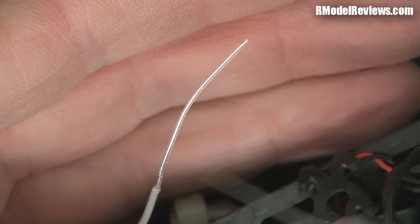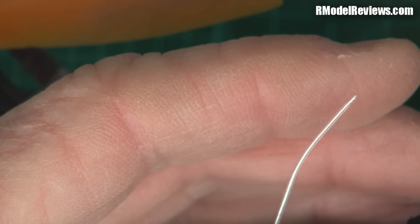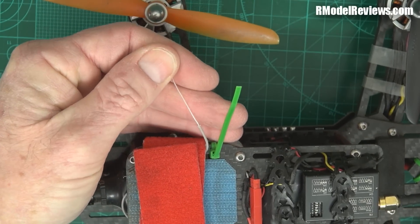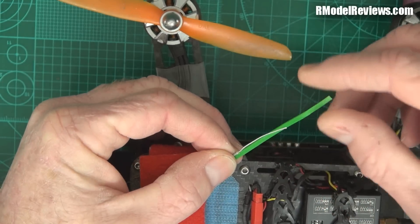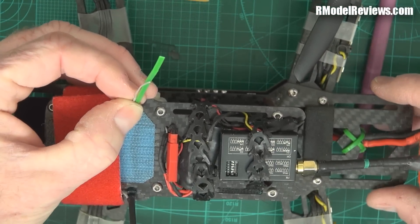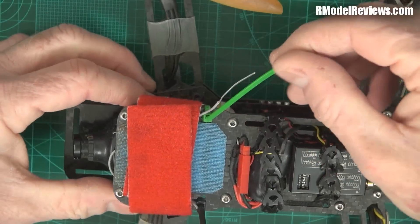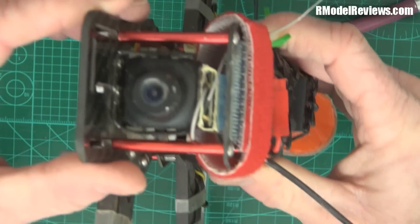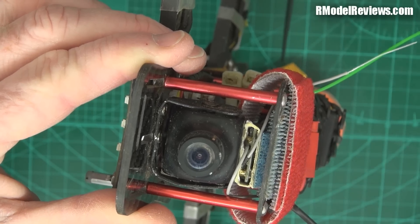One thing to remember: if you're cutting little bits of wire off, don't let them fall into any of your gear. On this quad I've got a Naze board under here — you have to be very careful that little fragments of wire don't land on it, because when you put the power on, smoke will come out. That's neat enough for me — 31 millimetres long, all done. Note it's not quite as long now because I've used up some more of the cable, but for a mini quad flying relatively close distances, this will give more than adequate operation. If the wire is cut very close to the receiver, you can actually change the entire aerial lead — most receivers have micro UFL connectors that let you take the whole antenna off and put a new one on.